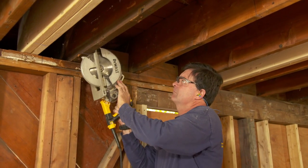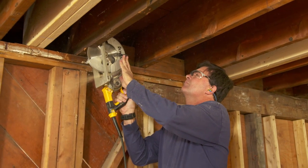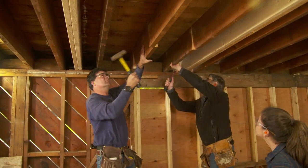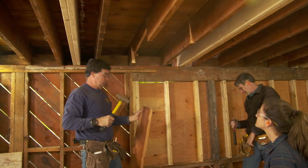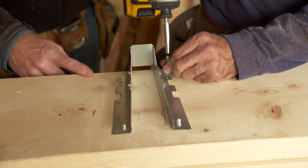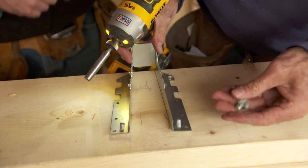So, Carly, now we want to cut the rafters in between. Now that they're cut, let's knock them out. Now Charlie's starting to work on the piece that's going to connect the two doubles. On the outer edge, we want to put hangers where we cut the joists. You won't be able to do it after the fact, so that's why he's putting them on now.